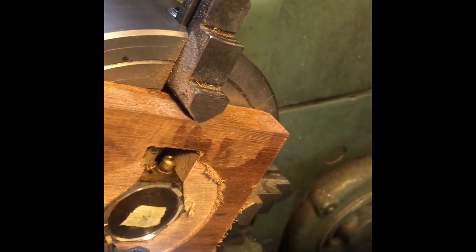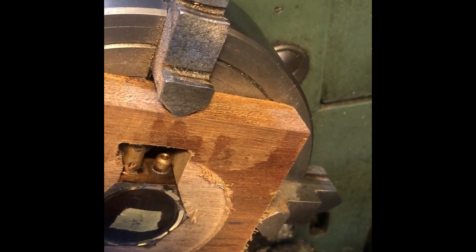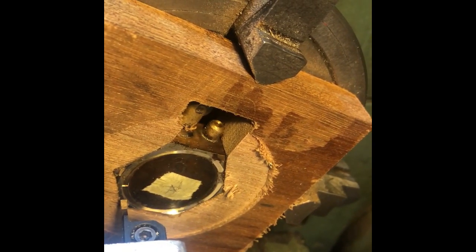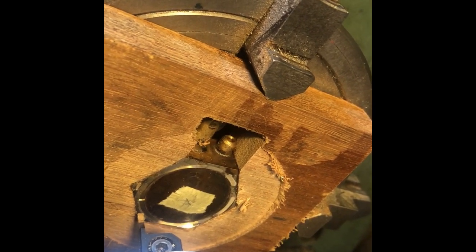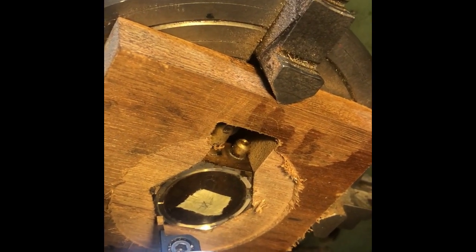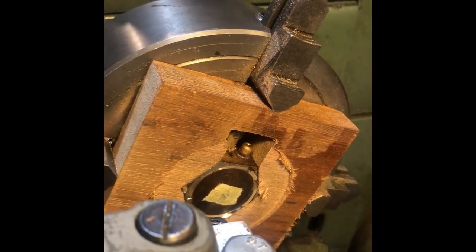The lighter may not be planar, so I might have to pack out the supporting block to make it perpendicular to the lathe axis — I expected it wouldn't be planar. When the tool starts to break through the solder and I start seeing areas of brass, I'll pack out with very thin shims wherever needed, until the tool has removed all the solder and is just showing brass all the way around, and then I'll know the lighter is planar. The penny is a little bit proud on both sides — for some reason I could not get it to fit down inside the recess fully. I'm worried that if I press too hard I'll flatten the dome or put a dent in the penny, so maybe we'll deal with that another day.